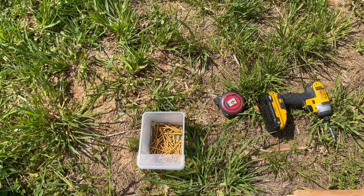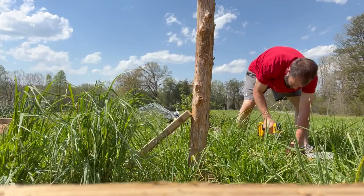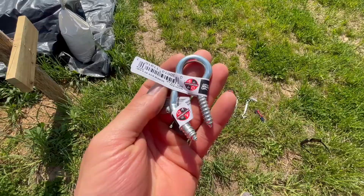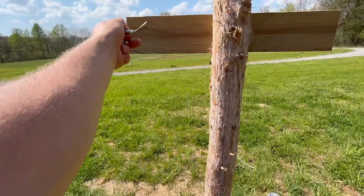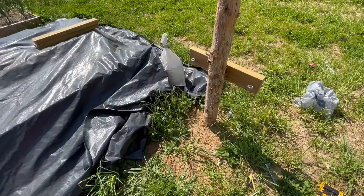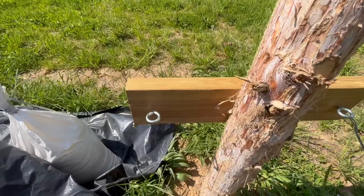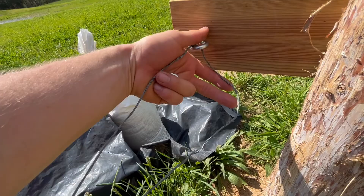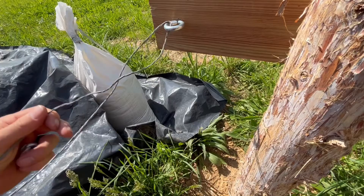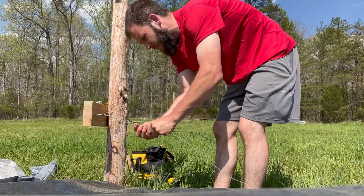Alright, there's one done — on to the other three. I'm putting the eye hooks in now, just spaced on either side of the cross member, probably just a couple inches inside on both sides, and doing that on all four. I have the eye hooks in and I put the cable on. All I'm doing is threading the cable through, wrapping it around a foot or about 10 inches, and then braiding it around just to give it a little more strength. I'm braiding it around and then just tying it together with the cable clamps to hold the cable in place and give it a little more pull strength.